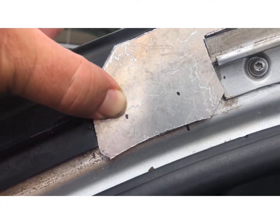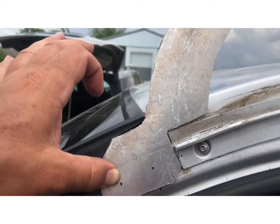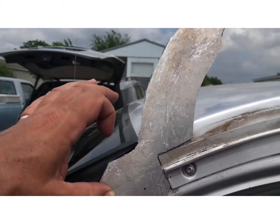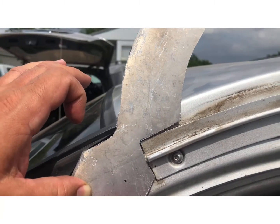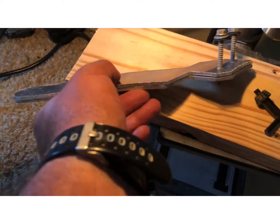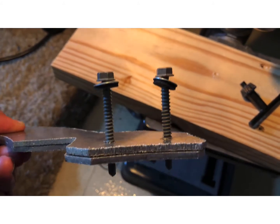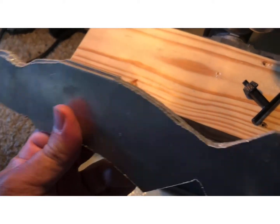Use a permanent marker and mark little dots on here where I want the bolts to go. Then I can use these two holes and bolt these two pieces together, and I will be able to match them up and make them perfectly identical. Use the drill press — put these two pieces together and drilled out the holes so they line up perfectly. Put a couple screws in there to hold it so that I can clean up all the edges and make them all fit perfectly.